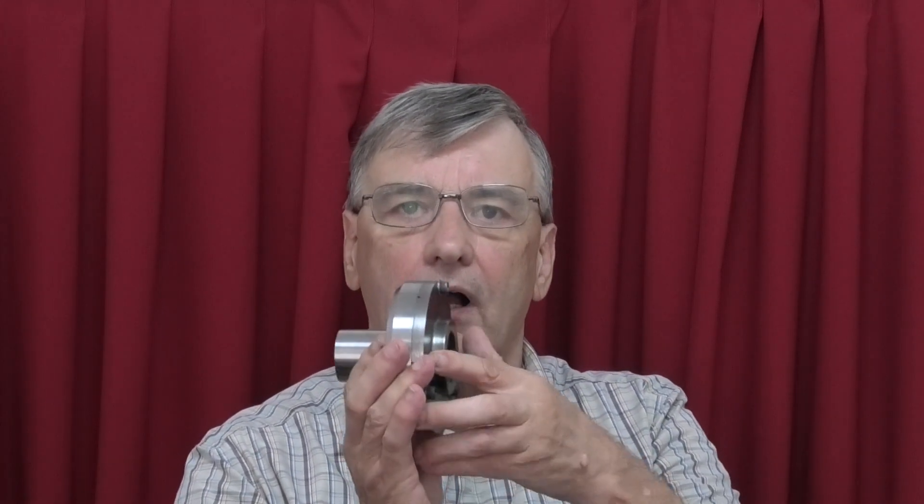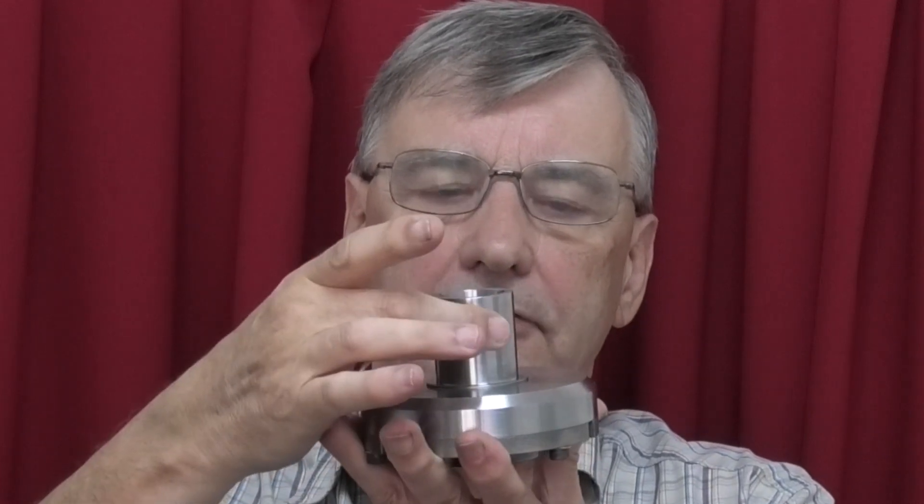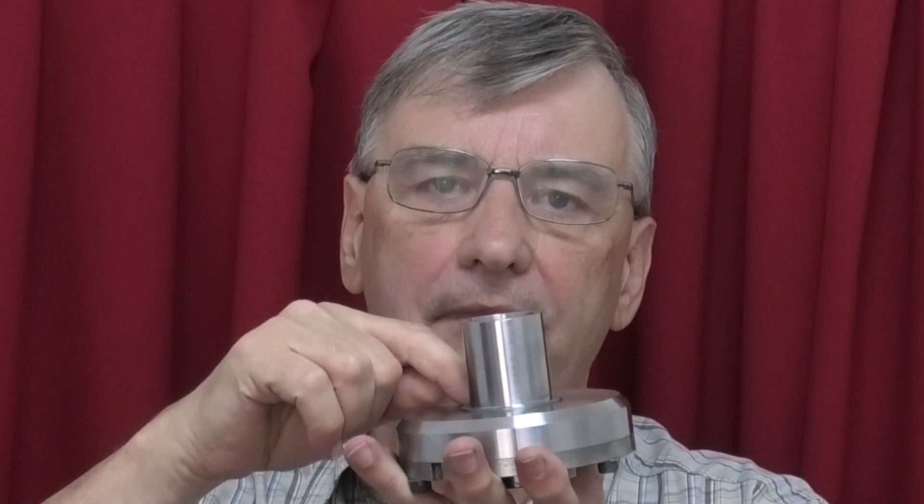Hello, welcome to E-Knots Engineering, I'm Alan. Today's video we're doing some screw cutting. This is a project for my brother — he's making a holder to hold an ER32 collet straight onto the spindle of the lathe. He's got a chuck backplate with the thread already in it, bored it out, inserted a steel bar, welded it in position, machined the outside down so it's all running true, machined a taper for an ER32 collet, and faced it all off. The problem is his machine is a Boxford imperial lathe and he can't cut the metric screw thread because he hasn't got a metric to imperial gear conversion, so I'll cut the thread for him on my lathe.